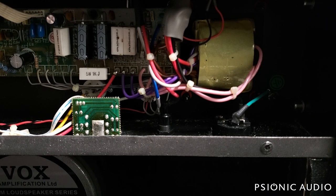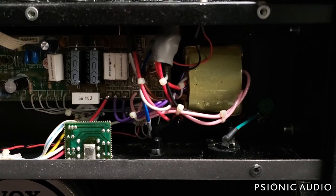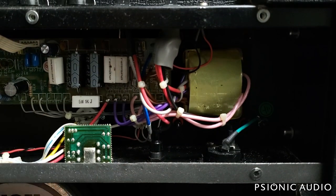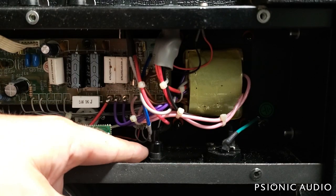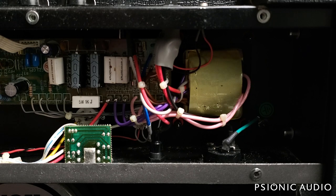This amp has three fuses. There's one on the board — it's board-mounted, a little 5x20 millimeter, 6.3 amp fuse in the heater supply. Second, there's the HT — the high tension supply for the B+. And that's the one the guy changed.